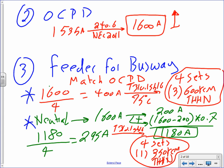For wire, what are they using there? Yeah, absolutely. It depends, I don't know what they're feeding. They must be using the neutral for something. Typically the only time we use a neutral, guys, is 277 for a lighting system, or 120 for receptacles or 120 lights too. Other than that, it would be a waste of money to buy a machine that runs single phase when you have a 3-phase system. But it could be.